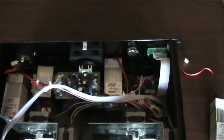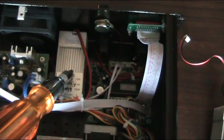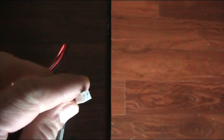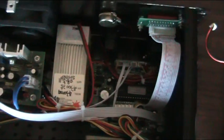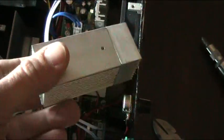A few of you have got this laser, so that's why I decided to do a video of this — just in case you have the same problem. I want to show you how simple it actually is. There it is — that's the old diode, and there's the one we're replacing it with. Basically it will just plug into the circuit board, just a matter of changing that with that. We've got to turn the thing upside down — there are two screws holding the laser diode in place. I've just got to unscrew those and it should pop out the other end.